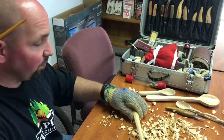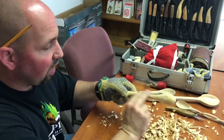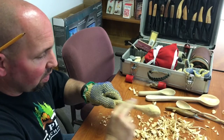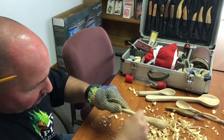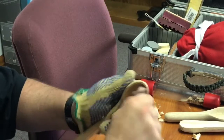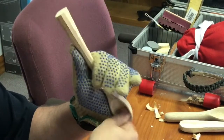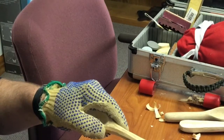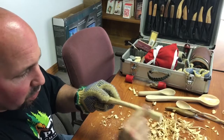Basically what you have left now is to sand it. I have a little bit of sandpaper — kind of like sandpaper from a belt sander, but just a little strip. You're just going to take that, and it's the part of carving that's the least amount of fun, but it makes the final product look good. It smooths out all the little divots and gets it all ready. When you go to sand your bowl, same kind of thing as when you carve it — just go around that bowl, around and around, and you'll end up getting it real smooth. On the handle there are still some lines and kind of an edge. With this really soft wood, we can actually sand most of that away.